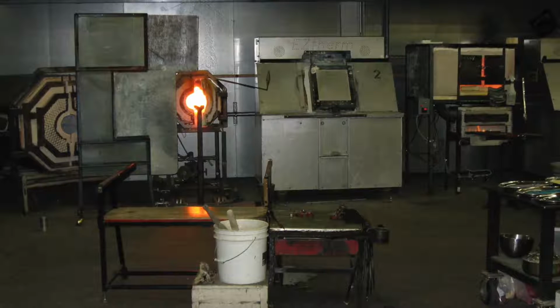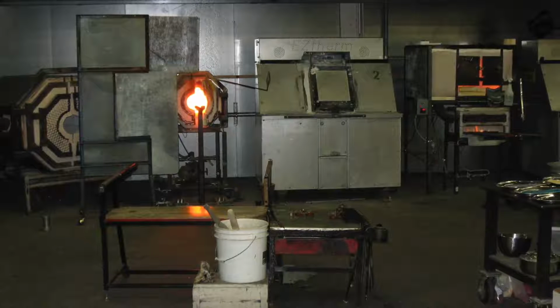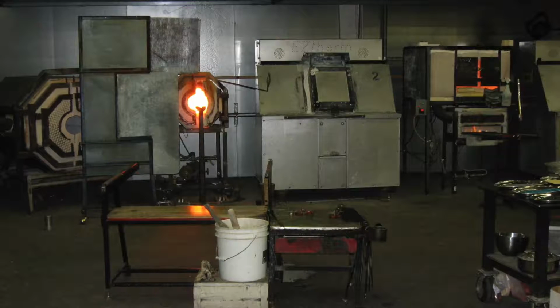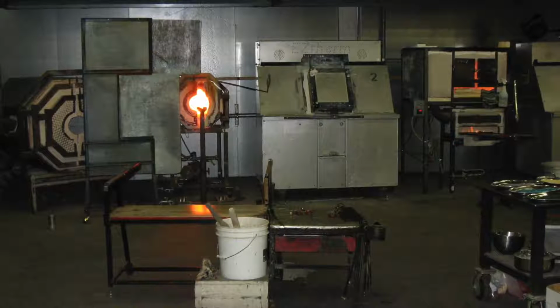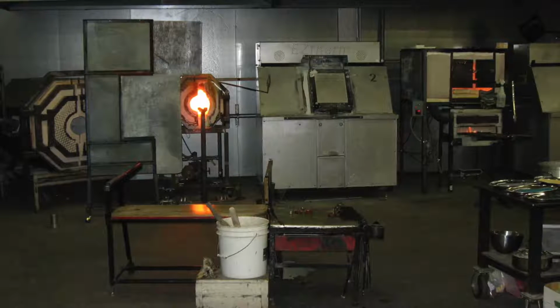Glass cools down pretty quickly when you're working with it and has to be reheated, and that's what the glory hole is for. The doors are opened and the pipe with the hardening glass on the end is placed on the support and inserted into the glory hole for reheating, then the doors are closed. The hole in the middle of the doors is so the rest of the pipe can remain outside, since only the end goes into the furnace.